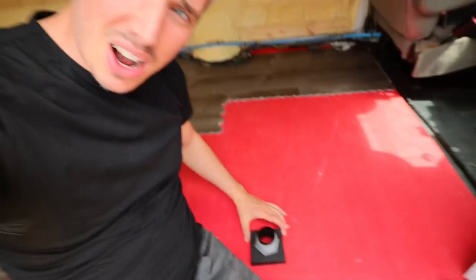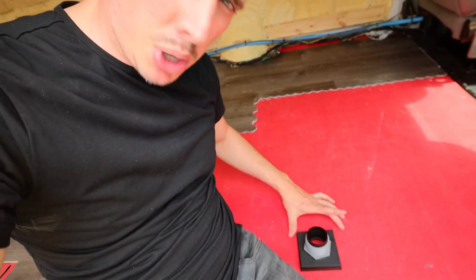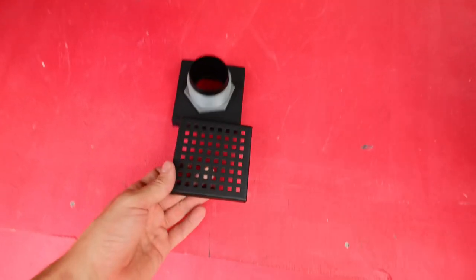Today's tile day. Will we get it done? Fingers crossed. So currently, we have the tile cut. Right now, I'm trying to position my drain and where it will go. This bad boy right here. I gotta make sure that when I make the cut, there's nothing obstructing its path underneath, which I'm pretty sure I have. But now the next thing to do is mark it on the floor where it's gonna go, and then go grab my tiles, bring them back over here, set those in place, and put that on top of the tile and mark out the tile and make those cuts.